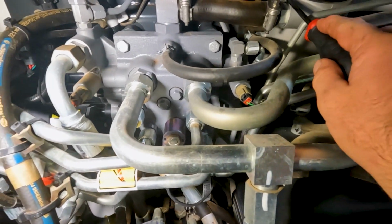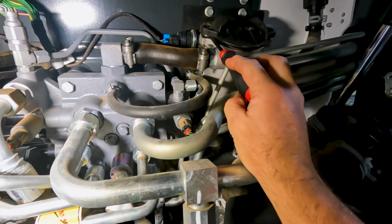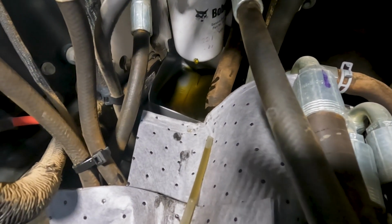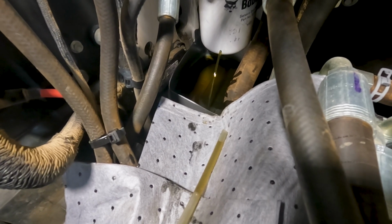So when I crack this hydraulic cap, this is draining through the case drain manifold. So I'm just slowly going to pry this up, and then watch what happens to the drain, where we're draining the oil there on the filter. See, it comes out a lot faster. I'm pointing this out because this can be a very messy job.